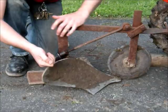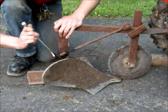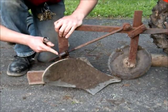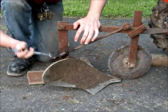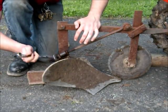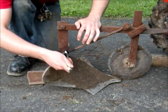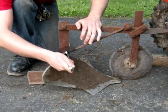Okay, one more time. So back this off. Now, I've only ever traveled on this thing through the course of this video. My extremes have been probably about 3/4 of an inch in travel on this bar. So it's not really a whole lot to get a decent sized change. When I first did it, this thing would sink in and stop the tractor. And in the last bit here, it would only cut about an inch or an inch and a half deep. So I made some good changes on this in just a short distance of the bolt.